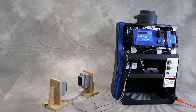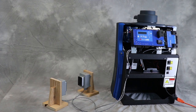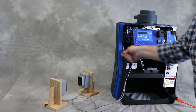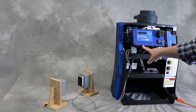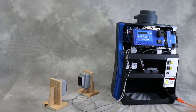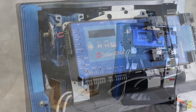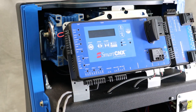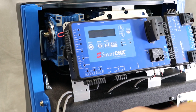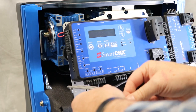I've got my two photo eye segments put together and I've run the wires to my gate operator right here. I haven't routed around the back yet, and we're going to plug them in here to the blue bus port on the smart connects controller. I'm going to pull this little connector out and put the wires into one side.